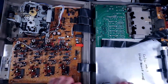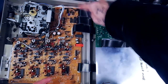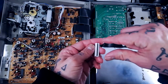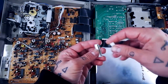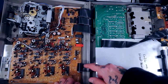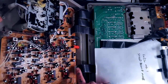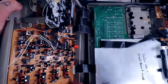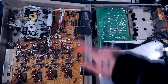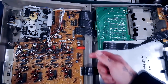Before removing the transport, note that five ribbon connectors are used in here. When the wires are fresh, the exposed wires of the ribbon cable just push in and click easily, then a plastic cap pushes down over the top. I've found to my detriment that if you remove those caps, they're really difficult to get back in. On this unit I've actually installed JST XH plugs instead. You don't need to do that, but I'd recommend not taking the caps off the original connectors and pulling the ribbon cables out.